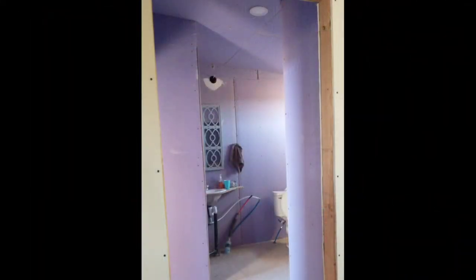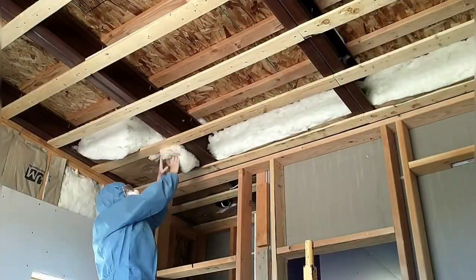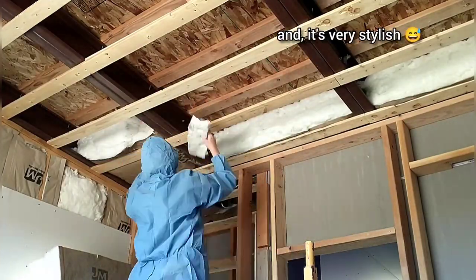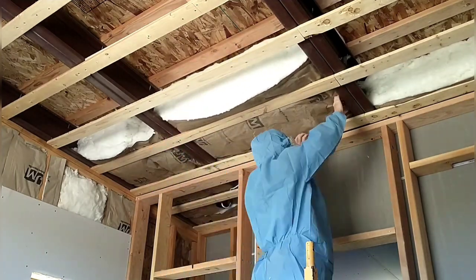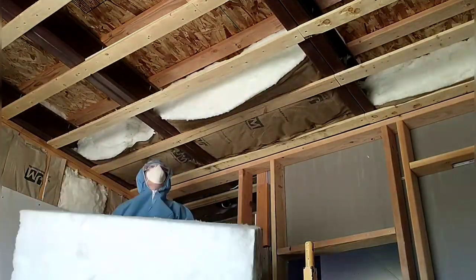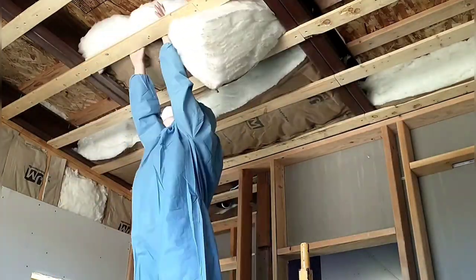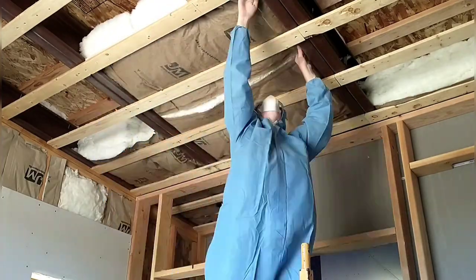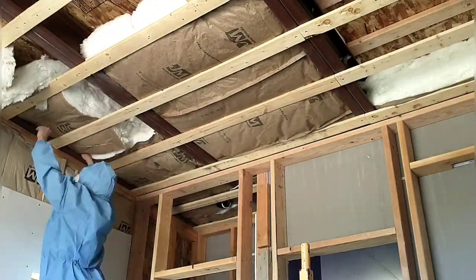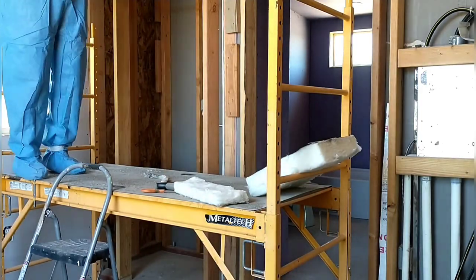Finished up hanging drywall in the bathroom — it's looking pretty different and really nice in there. We decided to go ahead and test fit the tub, which we picked up on our trip to Tucson. April's moving ahead into the bedroom to do the insulation — she's suited up in a full body suit that really helps keep the insulation from getting on her. April takes her time to make sure each piece is placed in properly, fitting tight against all the edges. You don't want gaps between the beams or between pieces of insulation because heat can transfer through those gaps. She's stapling the vapor barrier to make sure two pieces are tight up against each other with no gap. In the narrower sections along the wall she has to cut pieces, using scissors to cut them precisely to fit.